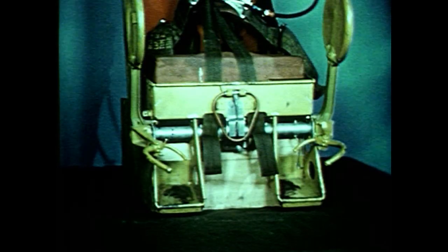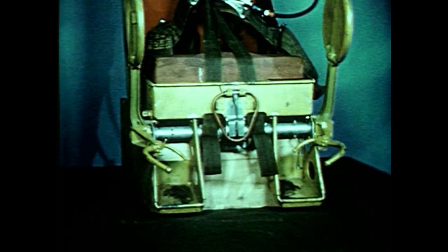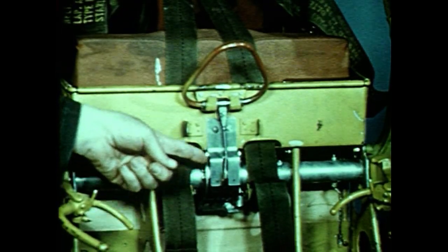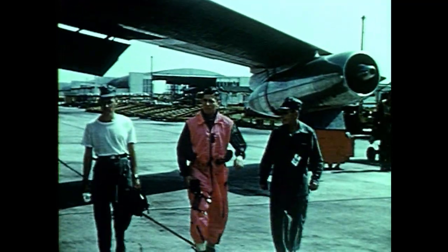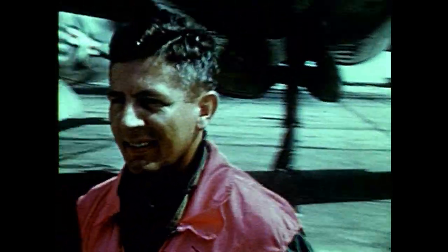This is the seat as modified. The D-ring surface was roughened. The cable to which the ring is attached was lengthened, and a shock absorber installed. Lock pins in the leg guards were reinforced and the shafts lengthened. With modifications to the seat completed, the second series of human downward ejection tests were conducted in July and August 1954.